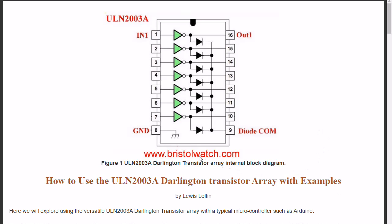You're looking at the device right here in the middle of the screen. It is a 16-pin device. It has seven inputs that connect directly to an Arduino or TTL digital circuit without resistors. The seven outputs are open collector.